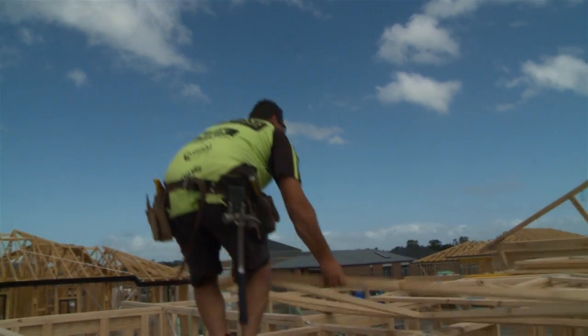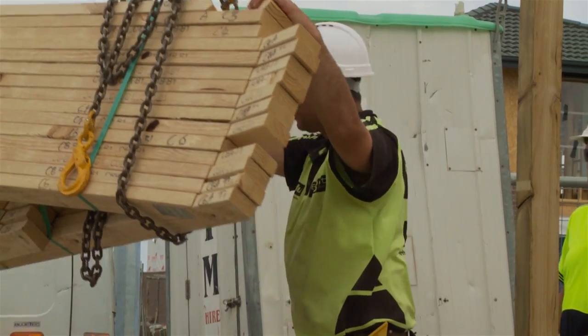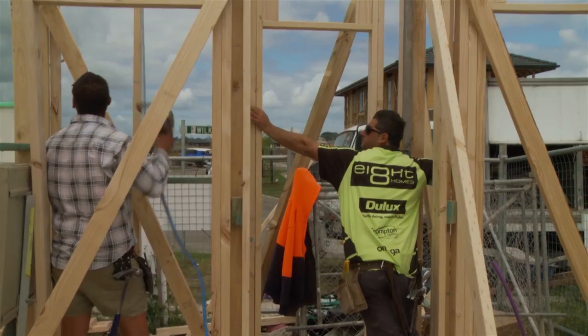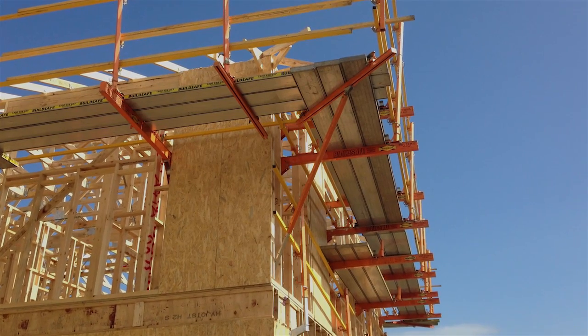C. Assess the weight of the trusses to see if they are too heavy for manual handling. You may need to use a crane for the lift. D. It's important to check that the walls are secured and strong enough to carry the truss load. Additional bracing may be needed, particularly to carry the load of suspended bracket scaffolds.